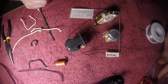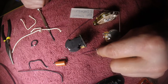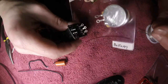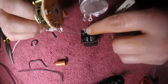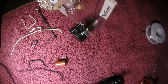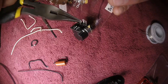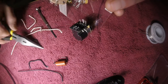Now, along with this push-pull tone pot, it's going to have one extra little jumper, which I created out of just a piece of wire left over from a previous build on a tone capacitor. With this one, you're going to want to jump lugs one and three. I've already got this cut so it fits right in there. The hard ones like this I like to get out of the way first, then you don't have to come back to it.